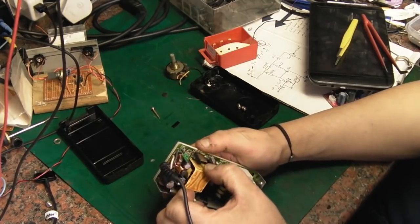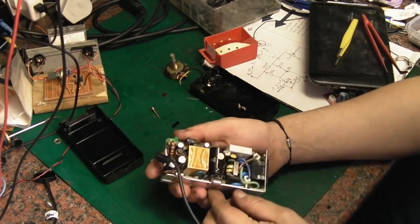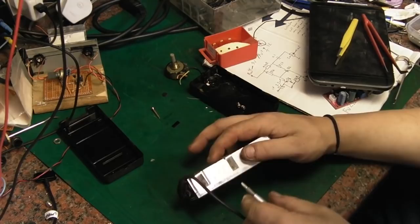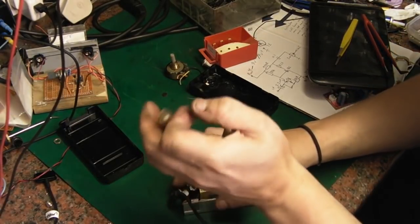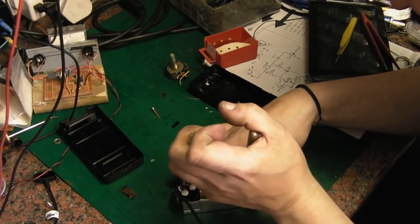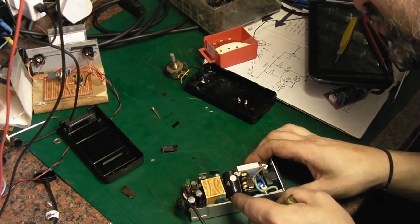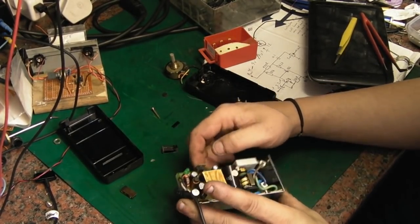We'll try and get this off its board and have a look underneath. I wonder if I can just try changing those caps and seeing whether it'll go again. We've got to pop these clips off to get the board off the heat sink. This one looks like it's melted — it's got heat shrink over it to isolate it from the heat sink, rather well melted heat shrink by the look of it. That's obviously been getting very hot.